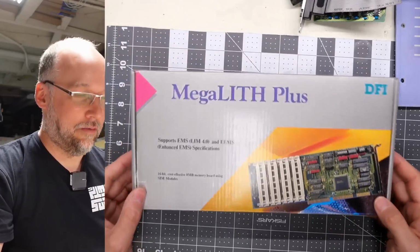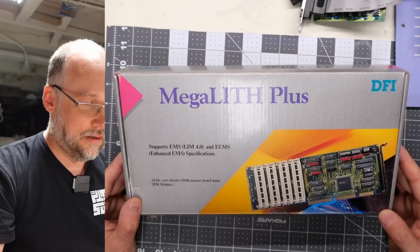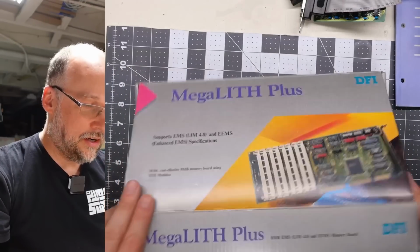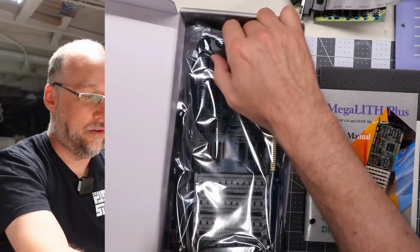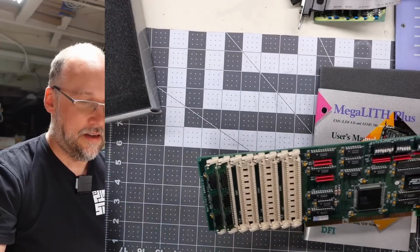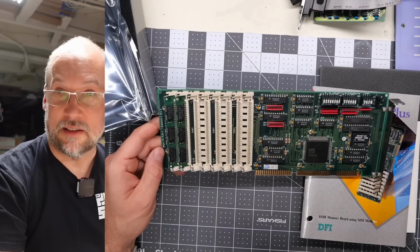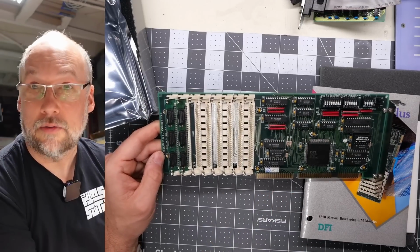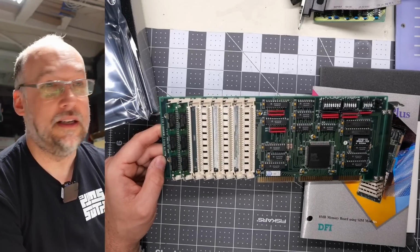And then next up we have this, and this is freaking awesome. Wow, so yeah, an EMS, extended memory card here, or EMS, and I don't know the difference between XMS, EMS, whatever, all those different things. What's awesome about this is, the ISA bus can support up to 16 megabytes of RAM. So that's like on a 286. And that's because the ISA bus was designed for the 286. Well, it can actually support more memory if you're using EMS and things like that.